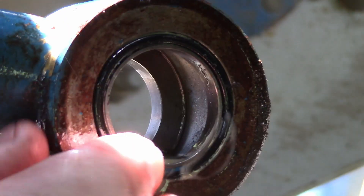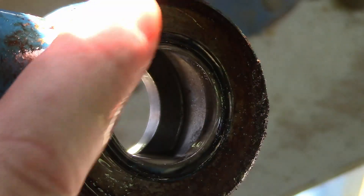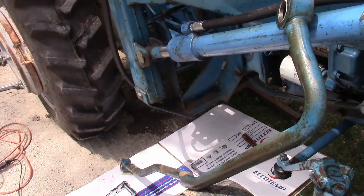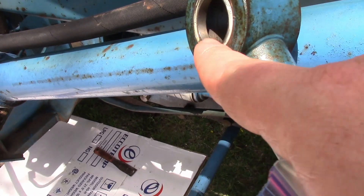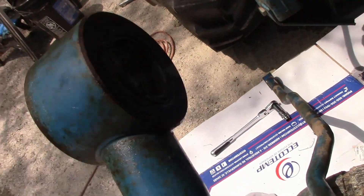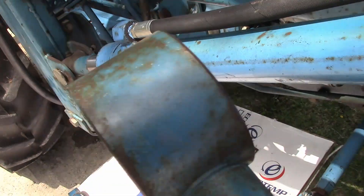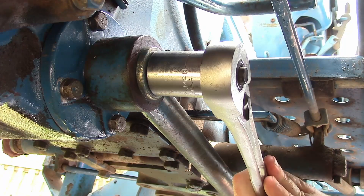On the inside of the pipe there's a little o-ring — pretty well compressed, with a little bit of sealant holding it in there. It's intact but it's been compressed pretty well; I can feel it's still kind of raised on top. I got the entire hard line loose. On either side of it there's an o-ring. I went and found the o-rings at my local hardware store — there's one on either side on both ends, so four o-rings total. I got the part number in the description.